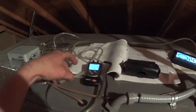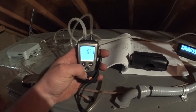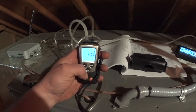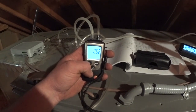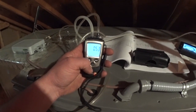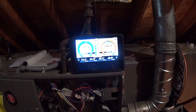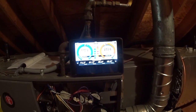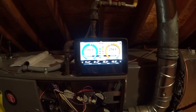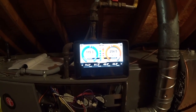That improvement should take our overall static down, and we end up at about 0.52 with no filter — not bad, other than not having a filter in. I'm going to stick my air probes in and go outside to get my pressure probes set up. The system has been running for several minutes now and my sub-cooling seems high, but I don't have anything to tell me exactly what sub-cooling should be on that unit.